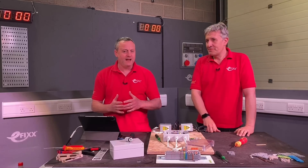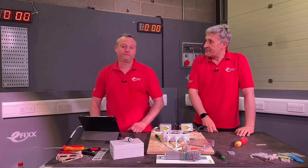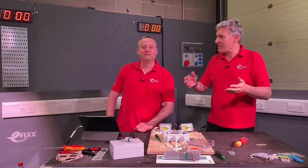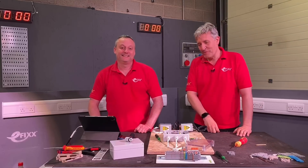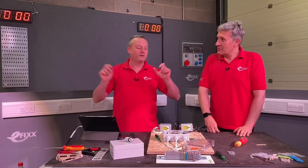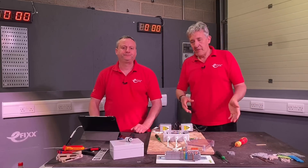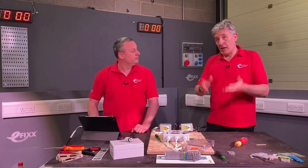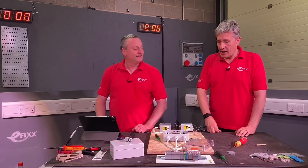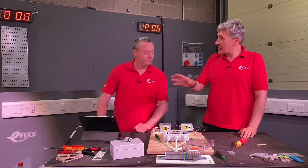What you're saying is that when you get into that area where a plumber has been, he's taken up a lot of the real estate in there and left us hardly any room to do our connections? Yeah, and then obviously there's another problem — plumbers sometimes have leakage and we have leakage in electrical systems, but they struggle with it too. It could be that your enclosure needs an increased IP rating, not necessarily because you think the pipe's going to leak, but because of higher humidity in environments such as boiler houses. You might be outside, and that happens a lot with renewable-based systems where you need enormous tanks and things do leak from time to time. So we thought we'd look at how we can build a wiring centre using the Top Job DIN rail terminals we've featured in previous videos.